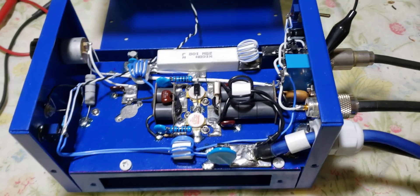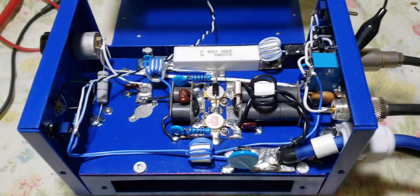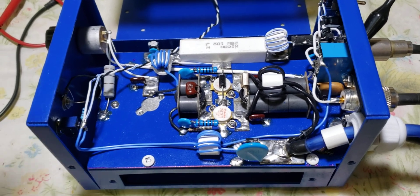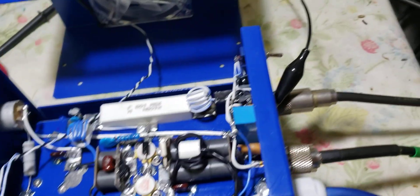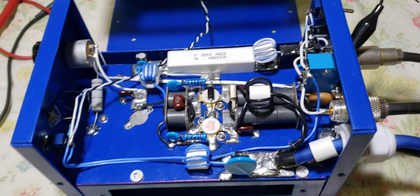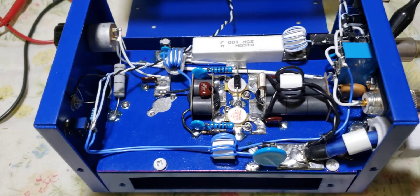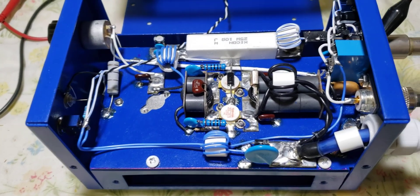I actually did one of these with my girlfriend. We didn't quite come up with a handle for her yet — we played around with a couple of names. But anyway, I built a little blue-painted one here at the house, not candy-painted at the shop. A little two-pill Toshiba B-Biased box where I laid the diode over the pill to help with temperature tracking. I had two people hit me up almost identically wanting the box, and the guy that came in second still wanted that identical build. So we went ahead and did that for him, but took it a little further — went ahead and painted the board for him and did a couple other things a little different.